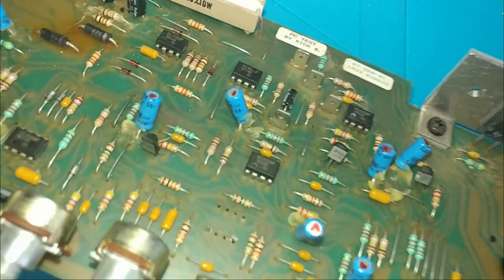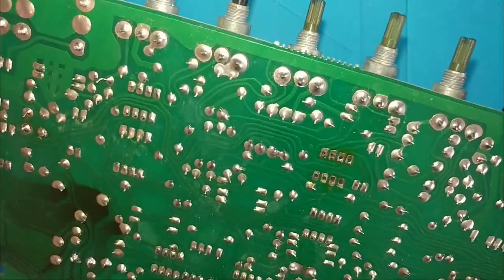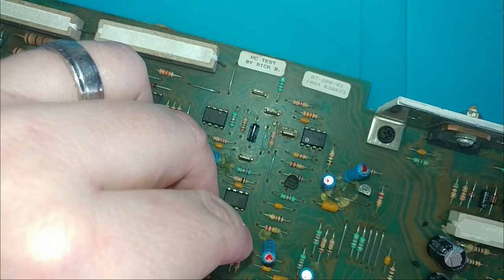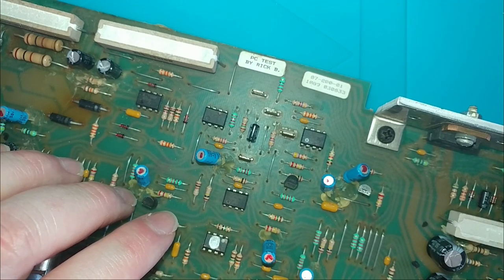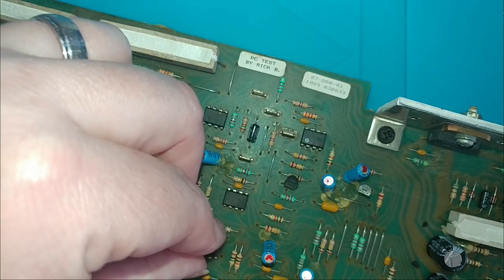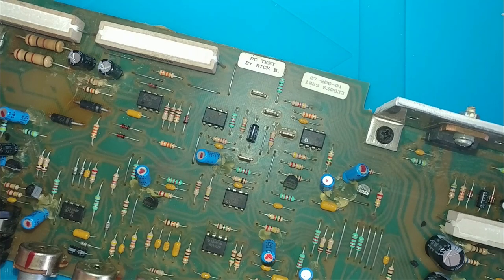So I've traced around as much as I could, and to the best I can figure, the series and parallel resistors and capacitors we have here, that is just the measured value between here. So I think it'd be safe to stick this op amp back in and solder him back into the board. Or what I'll do is I'll put that one in my package and solder this new one in, just in case there's something weird going on in the board that makes it behave funny after it's in.